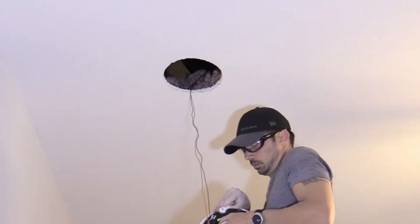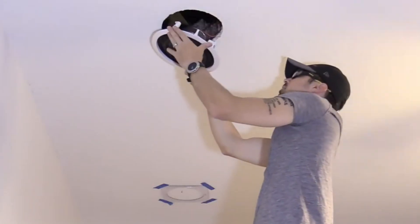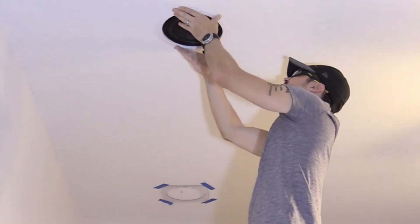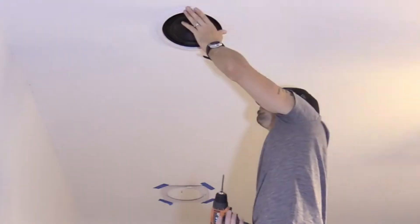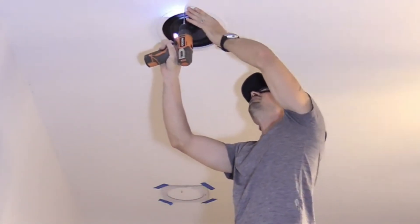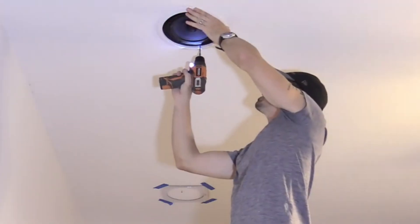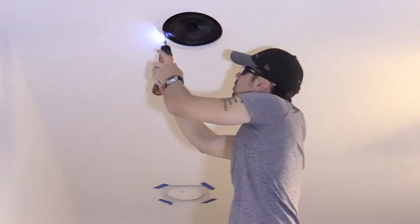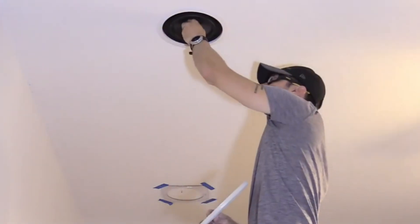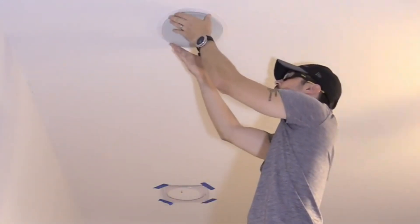Connect the red wire to the red port on the speaker and the black wire to the black port (negative). Make sure you turn all the wing nuts inward — the speaker won't slide into the hole if they're open. If using an electric screwdriver, set the torque to one or two and only screw into the Phillips screws on the outer ring. The wing nuts will clamp down tightly onto the drywall, but don't over-tighten the screws.